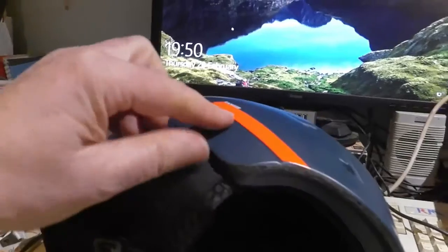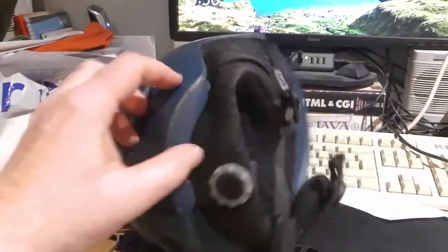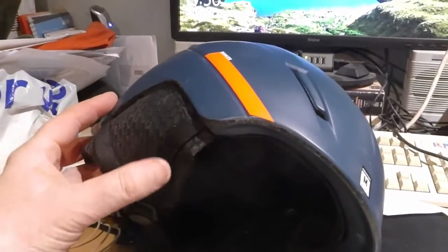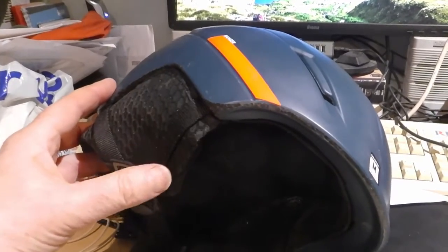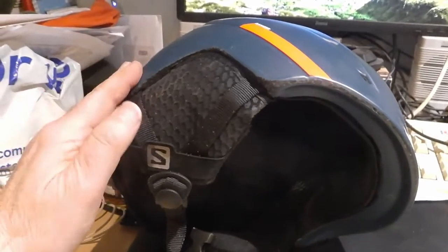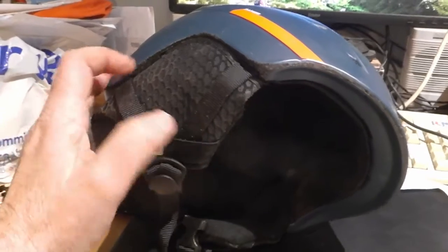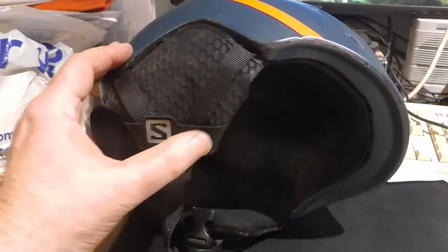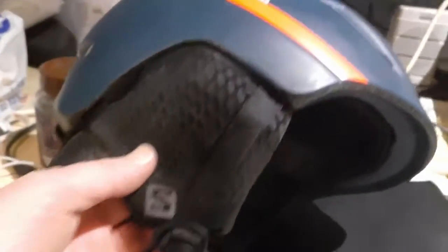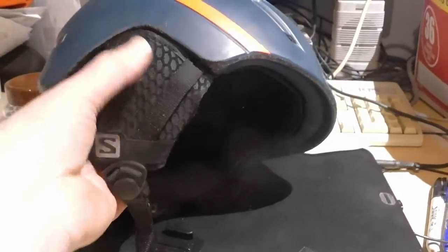So this is the lowest part of the helmet I can attach a mounting bracket to, or else I have to attach it here. I did consider attaching one here and having a boom arm coming out. I want the camera much lower down, but the problem is you've got a support point here and the camera out here — that's a lot of leverage on that bracket. So what I'm going to do is try to extend the helmet and put something hard here that I can attach it to.